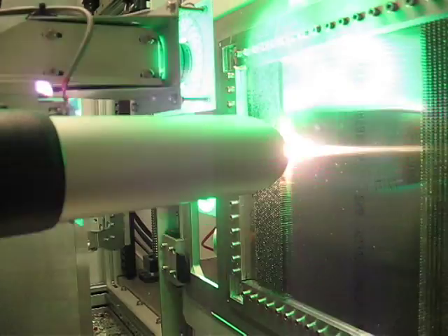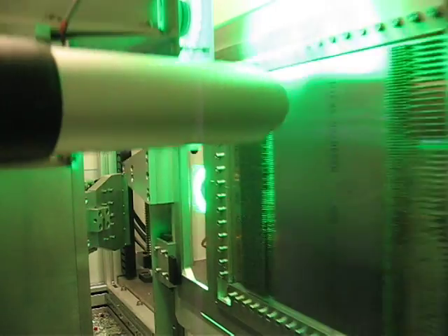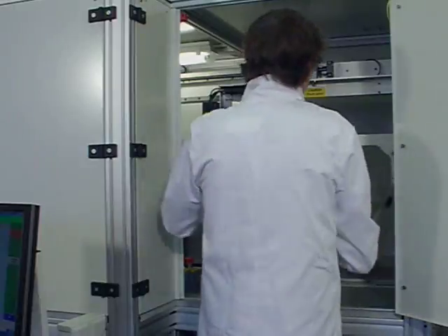The process is intelligent and programmable. Different sized cells and different pin array configurations can be manufactured with minimal changes to tooling. Vision feedback loops are used to accommodate weld shrinkage.